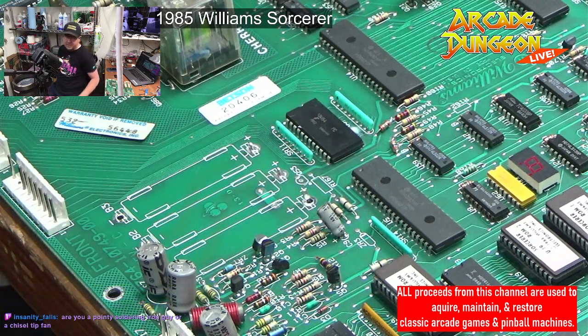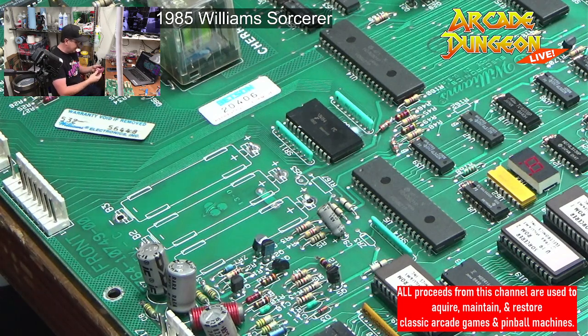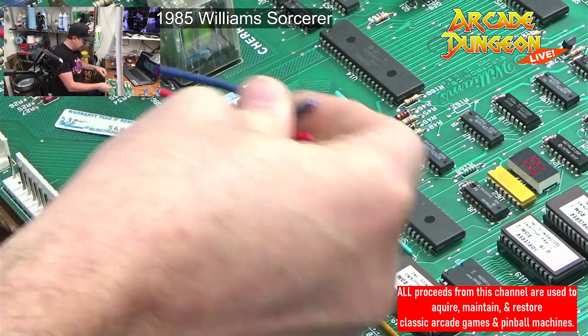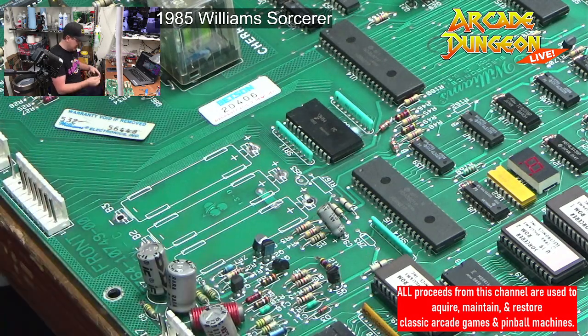And then we're going to use our favorite bit of wiring. This is our excess donated wire from the high speeds remote battery cable that went 10 feet long. The 10-foot remote battery pack, which was completely ridiculous. So we're going to take a couple of inches off of this, maybe a little bit longer, just so we have enough space. And then solder it in. And then we'll solder the connections onto this guy. You know, easy peasy. And then we'll check the voltage.